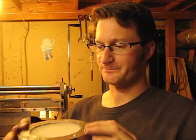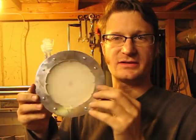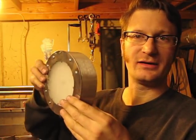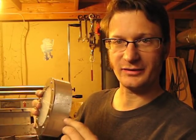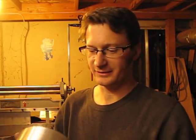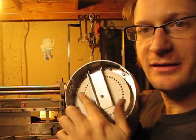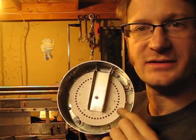I've finished attaching the side to the clock — here's what it's going to look like finished, which it essentially is finished. You'll notice I've got it seamless now. I recently bought a spool gun for my welder, and I'm looking for all kinds of excuses to weld aluminum now. I would say that welding aluminum this thin — 0.06 inch thick — is not easy, and I don't know that I'll attempt something like that again. I welded the seam together and then added some tabs to attach it to the front of the clock body.